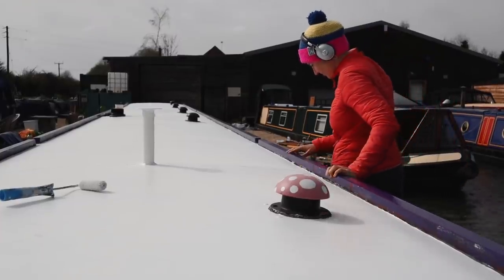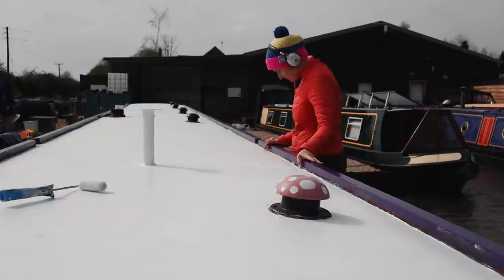This morning I inspected the roof and found one small imperfection where the paint is flicking off, which is quite good for the whole entire roof - just one little thing. So I'm going to go and fix it. It's going to need a couple of hours before we start the top coat. We've been told it's best to paint above 10 degrees Celsius, so that's going to be at around two o'clock. But because it's a sunny day, the roof will probably be warmer in the sun, so we're going to wait till about one o'clock to start painting today.